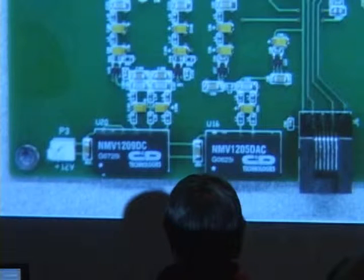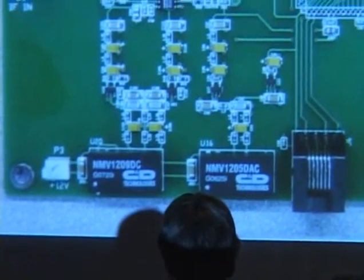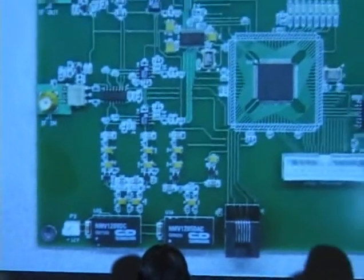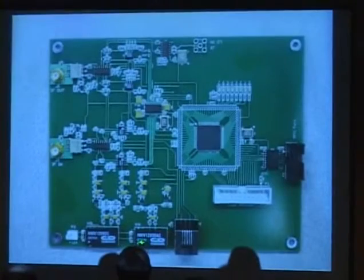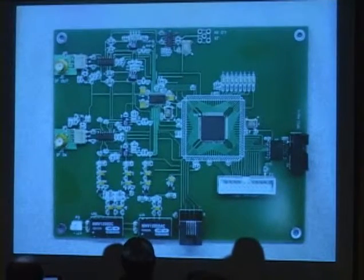These are power supply switchers. The 12 volts comes in. This one breaks it down, first of all, to plus and minus 9 volts, which then gets regulated and filtered to plus and minus 6 volts, and then sent up to the op amps that are up here. This switches from 12 to 5 volts and then gets changed to 3.3 volts digital and analog. And I can talk more about the design of this board because I did it. This one here, and if you're interested, we can take that offline.